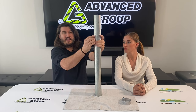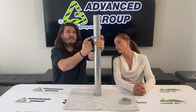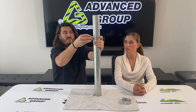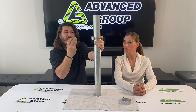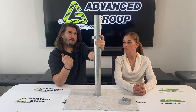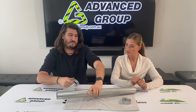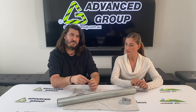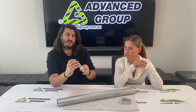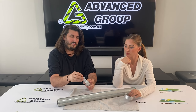It can't move once it's tight — it won't go up and down or left or right. It'll be the perfect amount of adjustment. So you can't just use any old M10 bolt because the taper allows it to dent into the pipe just that perfect amount so that nothing breaks, nothing over-tensions, nothing's under tension. You can do it by hand and then everything can be tensioned perfectly without having to worry about whether it's tight enough or not. You know it's not tight enough if the sign still flaps around on the flat part of the bracket — if there's a gap there that's flapping around, it could be pretty irritating for someone nearby.